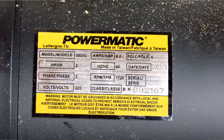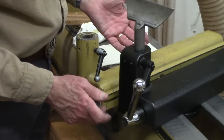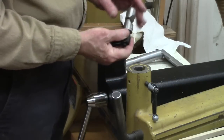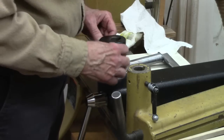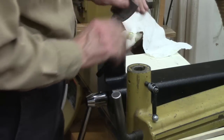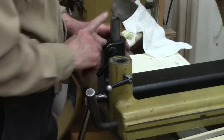The banjo is an extra nine pounds. I have both the B and C model banjos mounted on the B model bed — they're interchangeable since the bed way is the same width. Cosmetically the C model banjo is a little bit nicer, and they both lock extremely well. One of the nicer upgrades is the locking mechanism, which clamps down on both sides very effectively with a ratchet handle that locks down super tight. I really didn't like the B model banjo because it shifted a little — it basically uses a screw into the tool post, so it doesn't hold nearly as strongly. I put up with that for 14 years but I like this one much better.